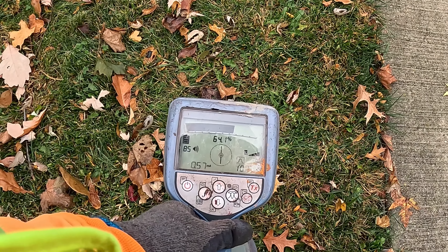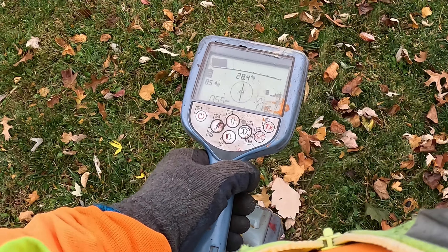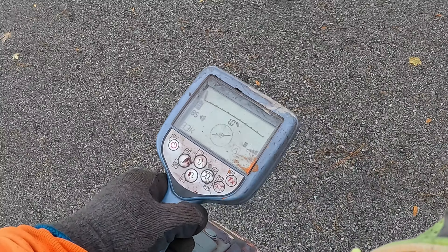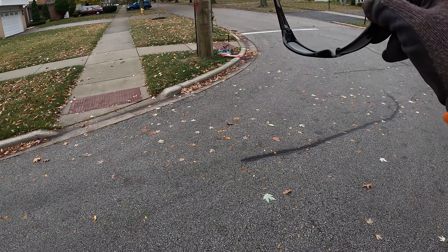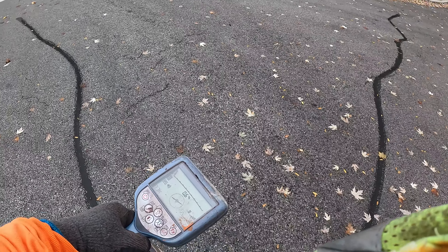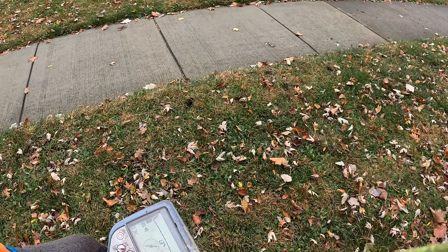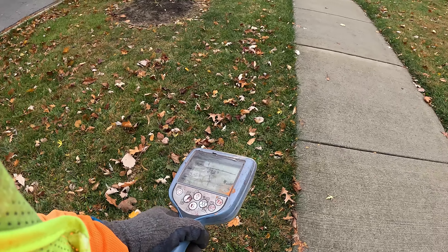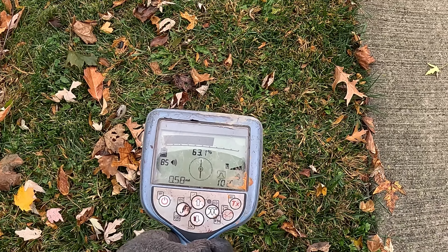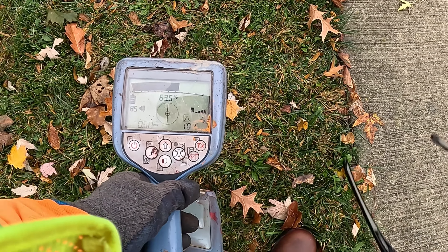I'm not getting enough milliamps, but I'm at one foot and I'm getting a 0.57. Let's finish our sweep. Still maintaining my 30 feet away from that pole as I'm sweeping — it's very important to stay the same distance when doing the sweep. I'm almost done with my radius sweep. My tone turned here — one foot. I'm sorry guys, I know the receiver is messy; I didn't clean it. I've got to buy a brand new one — these days it's too much money; they went to 10 grand for one.